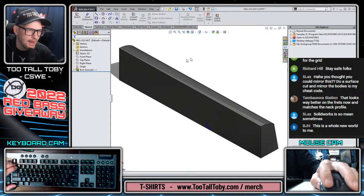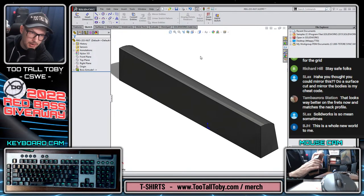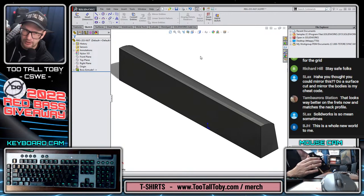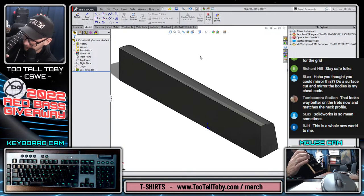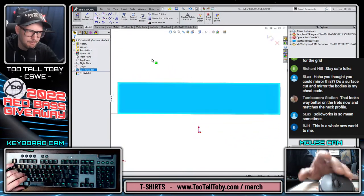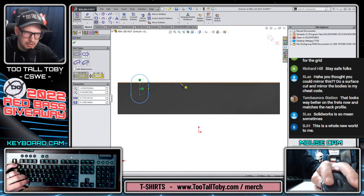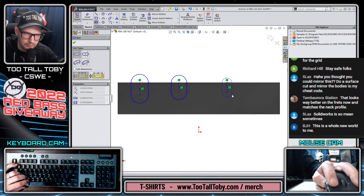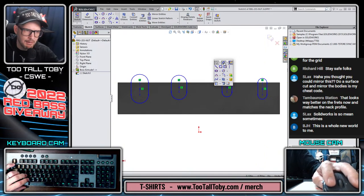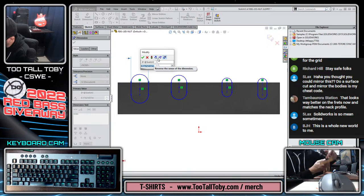Okay. So now we need to create the remaining geometry of this thing, which is basically just four slotted holes that are slightly different in depth and slightly different in width. I could just start out by laying this out here, with a slotted hole here, a slotted hole here, slightly smaller, and so on, each slightly smaller. And now we can start using our caliper to measure the width of those slots.